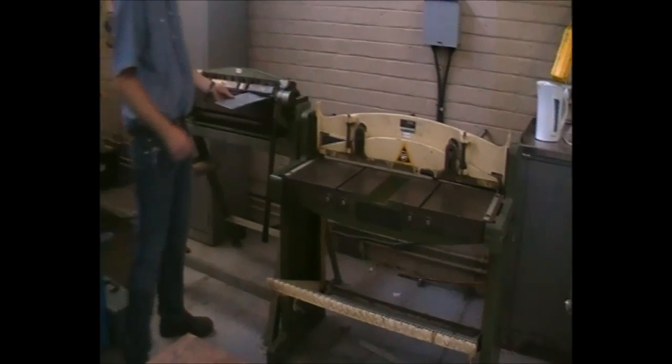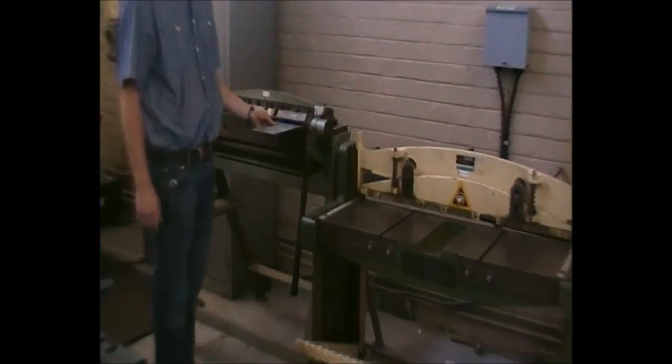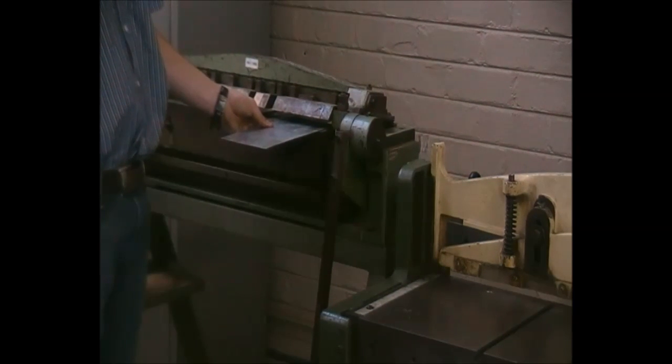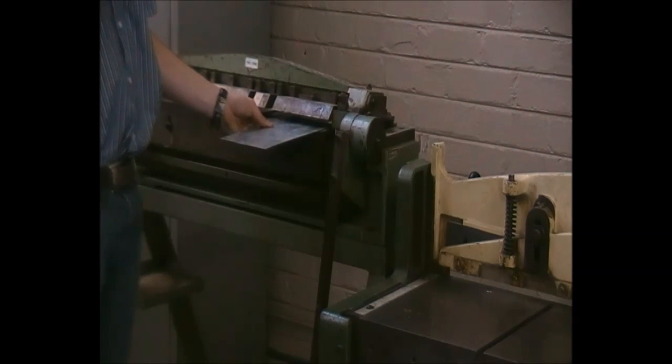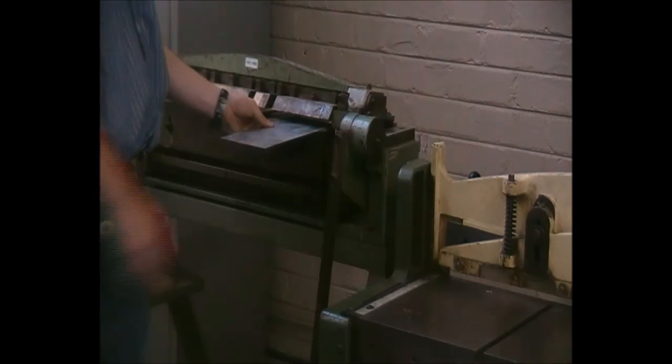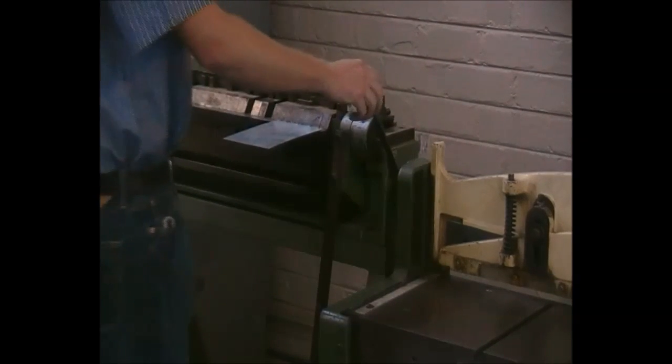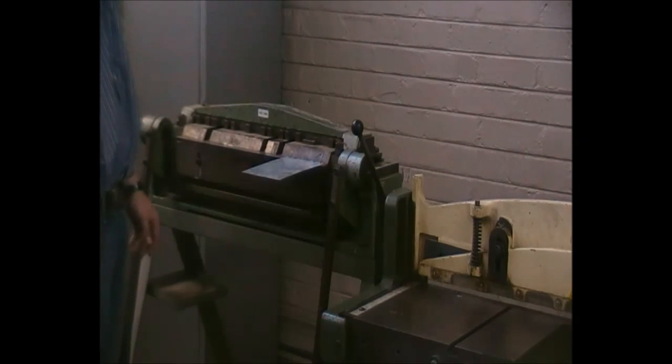It is sheared off at 90 degrees as we have placed it to the corner. We can now place it in our bending machine — the green ones handle up to 1.2 millimeters, the blue ones up to 1.6 millimeters. Please do not override these specs as this will definitely damage the punch or the die. Please make sure all the correct PPE is used. In the instance of bending, it is definitely possible for the parts to shatter, so please wear eye protection and closed shoes.